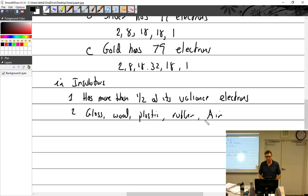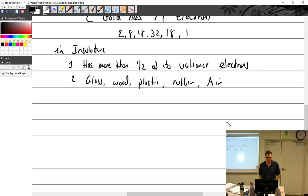The problem with magnetos is when you get to high altitudes and you start losing the air, they misfire and fire off the wrong cylinder, and you can actually damage the engine or lose your power. So piston engine aircraft that fly at high altitudes pressurize them. They take air right off the turbo or supercharger and blast it into the magneto, just like you'd pressurize the cabin of an aircraft. Is that because the air gets thinner the higher you go? Yep, there's not enough there, so you lose your insulating power. It does not easily give off electrons.